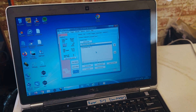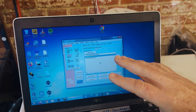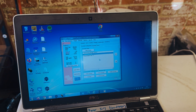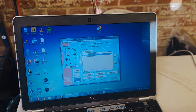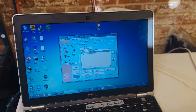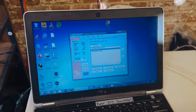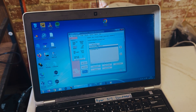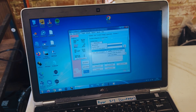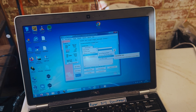In this demo I'm not going to show you how you actually get to VE Configure — we assume you already know your way around this, you've plugged it in, you've chosen the port, and it's downloaded all the info from the MultiPlus. You see we're running ESS, but this has nothing to do with ESS, which is the energy storage system. It is the programmable relay, and as you can see we have loaded this assistant twice. You need to install it twice because the first one is where we turn the load dump on, and the second is where we turn the load dump off. To add these assistants, you just go to Add Assistant, go down to relay, and choose programmable relay. As I said, you're going to need to load it twice.